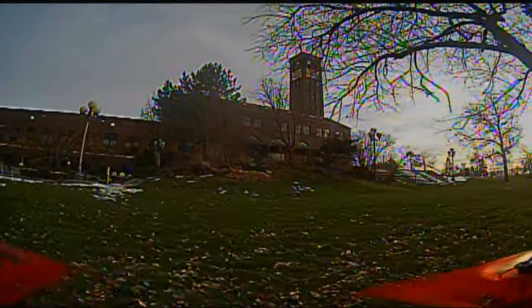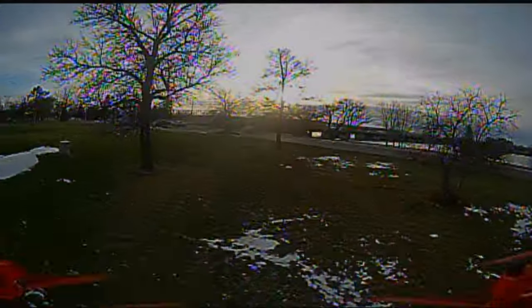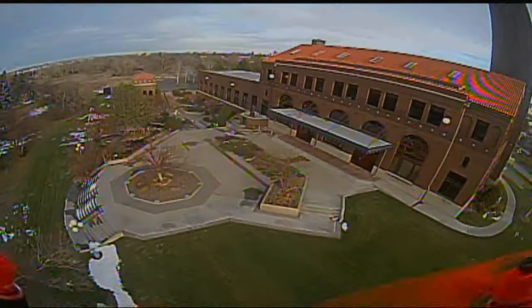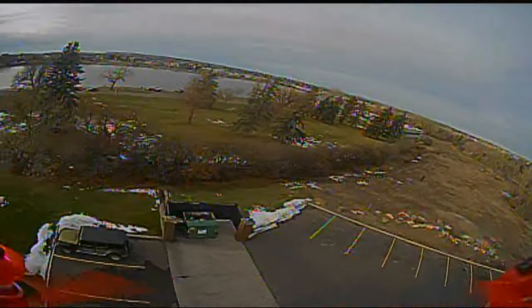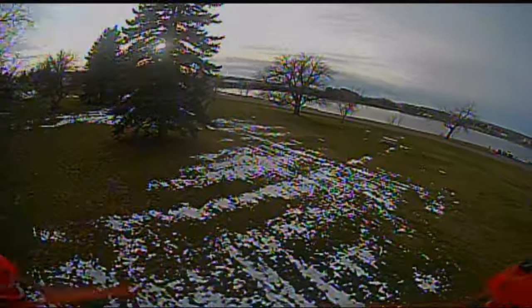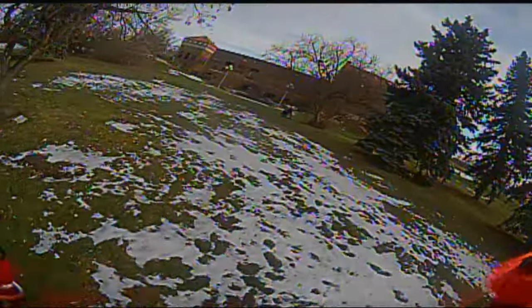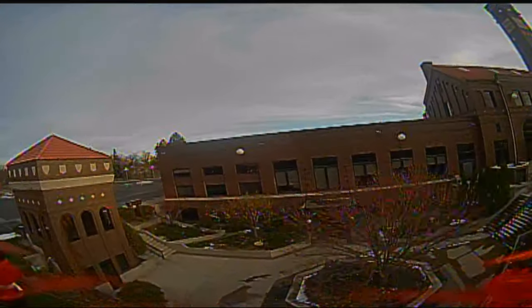We're here with the flight video. This is the DVR that's built in on the craft itself. I think they did a really good job. However, one thing I noticed — it stretches out to 16 by 9. I don't know why; it's supposed to be 4 by 3. I tried to fix it in my software but it just won't let me. This is how it records on the craft, and that's why you're not seeing any breakup lines. Not that there really were any, because it is 200 milliwatts and it is a decent VTX — so it's very clean.